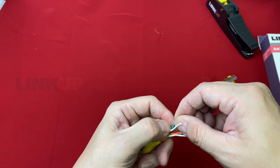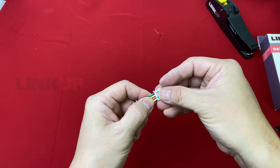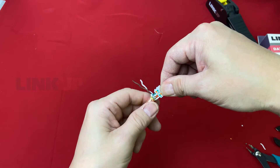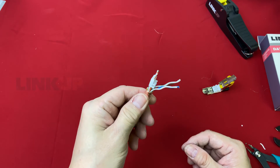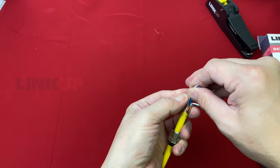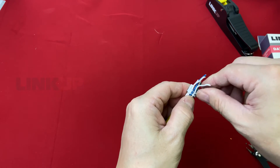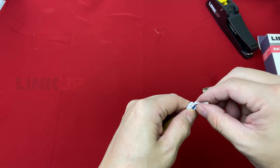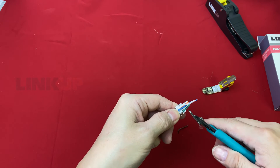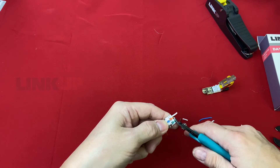Let's insert the green and orange first. Once completed, flip the cable and loader. The blue and brown pair are to click on with little pressure. We simply cut the extra wires which are sticking out of the loader edge, starting from the blue and brown pairs. Please make sure there is less than 0.2mm sticking out of the loader piece.